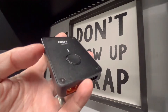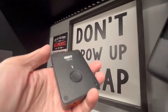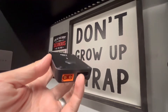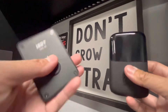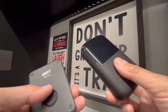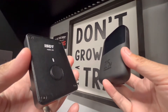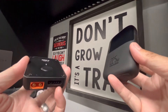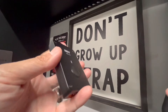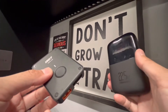The reason we can't charge 4, 5, and 6 cell batteries has nothing to do with the limitations of the charger itself — it has to do with the limitations of the power source going into it. If we're using a LiPo battery as the source, you can use 2S to 6S and charge another 2S to 6S battery. The limitation, within the scope of this video, is that we're charging using a battery bank, and the battery bank has a limited output of 12 volts. Twelve volts is basically a 3S battery or less — not 4S or higher. If you're using a giant LiPo battery as your source, you can do pretty much anything you'd normally do. It's just the battery bank that's the limitation.